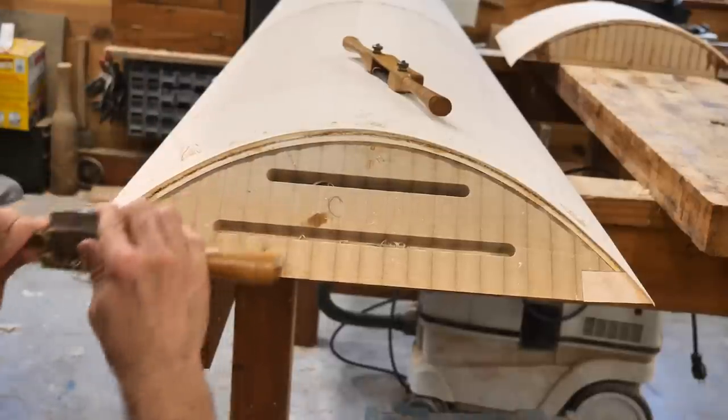Everywhere we had a rib on our frame, the bag had actually crushed down a little divot with that much force. So there wasn't any support there. And now instead of having this perfectly flat paintable surface, we have these little ridges and divots, which cost us a lot of time, unfortunately. It was a bit of a mess. You can't paint it that way because anytime you paint something with a sheen, you're just going to see any imperfection. And I just can't have that.